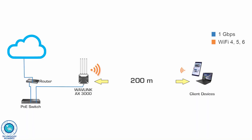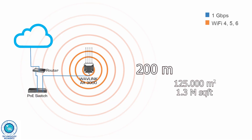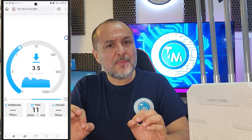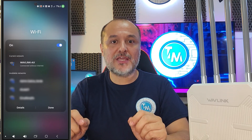We then took our network clients 200 meters out. Right there we were covering more than 125,000 square meters, or 1.3 million square feet. Signal quality degrades at this distance, but I tested from my Samsung S24 Ultra and an iPhone 14 Pro Max — mobile phones that may be the most troublesome clients for this type of network. Networking speed was not the best, but very normal for navigation and video calls. I finished tests at about 300 meters, which is almost 1,000 feet from the access point — 300,000 square meters or 3 million square feet. I couldn't maintain direct line of sight. The phone connected but wasn't strong enough to communicate well; a PC with an external antenna or a laptop could have connected.